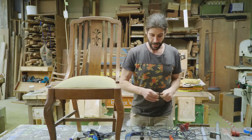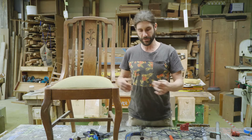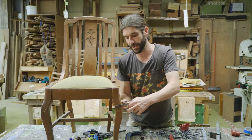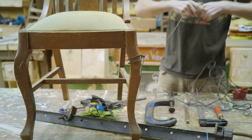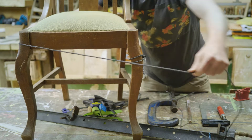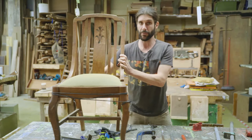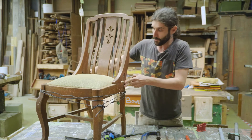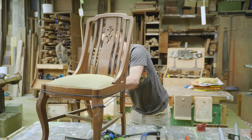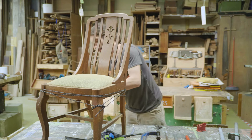So what we're going to do is, say with this chair here, we want to apply clamping pressure around it — say if we're repairing it and we're regluing the joints. I'm going to firstly wrap this rope around the chair and tie it to one of the legs. Any knot is okay, it doesn't really matter, just something that holds. This is if we wanted to re-glue all the joints in this chair. We use this a lot at our repair cafes where we might start the glue up with a clamp, but then we don't want to give the clamps to the people to take home because they're expensive. So we can hold it together using this method, but you could also just use this at home for your glue up.